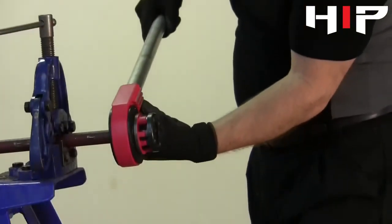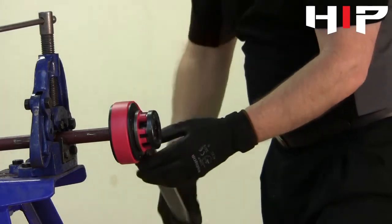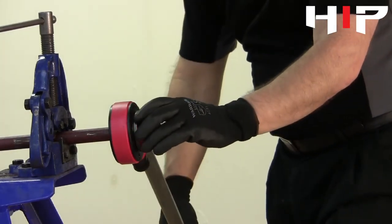After you've been down about five or six times you will notice that the swarf is starting to curl away into the dies. It's very important that we then clean the thread out — pulling the stopper out and changing the direction of the ratchet, we will now go backwards clearing the threads.